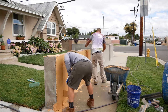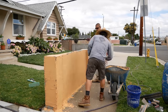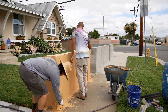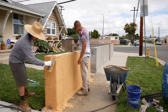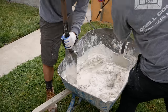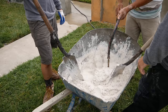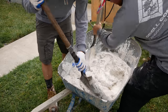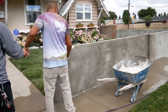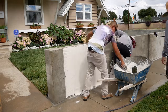The important thing about putting the stucco on, and even the brown coat for that matter, is keeping the wall wet and the brown coat wet between coats. The application is the same procedure as the brown coat — trowel it on, let it set, then get the sponge. You can go with the red sponge or the green sponge. The green is going to give you a little more texture. The red is for smoother finishes. In this case, we're going to go with the green sponge.